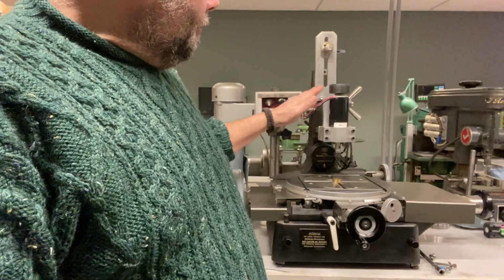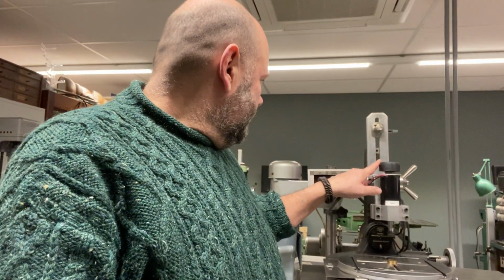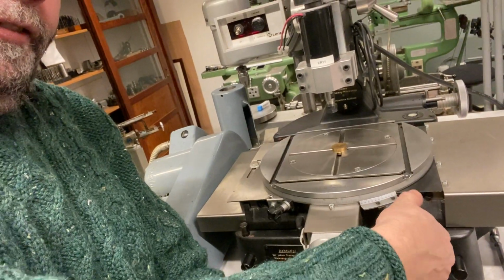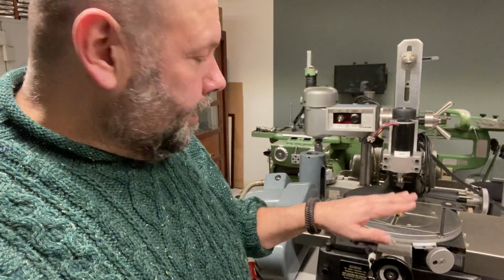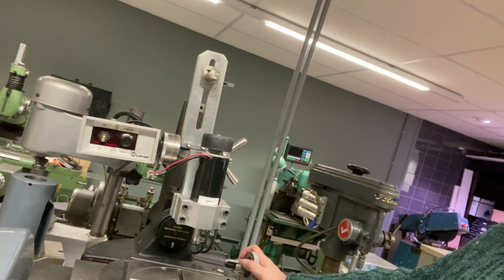And the Geneva stripes are done here with Kleine Karl. It is originally a microscope for tool making, but with a new spindle of 20,000 revolutions, high revolutions, and a beautiful cross table, really smooth. And so it's a cross table, but revolving as well. So pretty cool. And that's why I went to Bayern, southern Germany, to pick this one up. Cross table and rotating, and you can see the spindle tilting. Ooh. Now you are tilting here. And that is really important for the Geneva stripes, because you have a slight angle and then you get a beautiful groove.